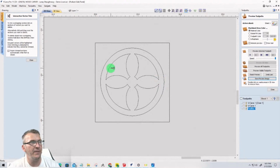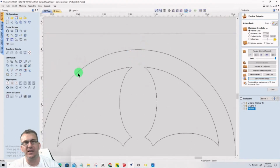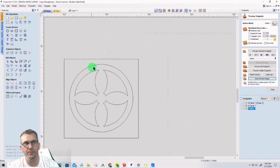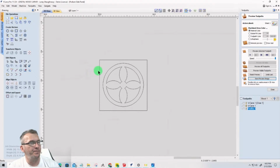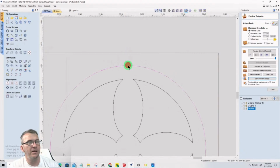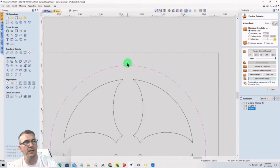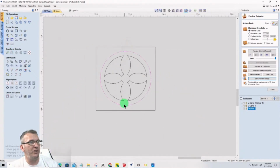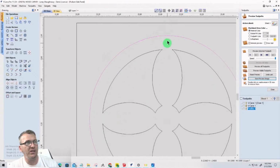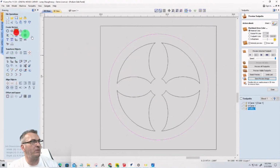That creates that shape. Now I'm going to create a 1/8 inch wide rectangle that sticks up past, outside the circle, by 1/8 of an inch. So the distance from here to here is 1/4 of an inch, because if you remember, my rectangle is 1 3/4 and my circle was 1 1/2, right? So that should put 1/8 of an inch on each side. Sorry, not 1/4. That should be 1/8 of an inch here, here, here, and here because of that 1/4 inch difference. So all I have to do is take a rectangle